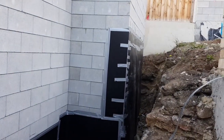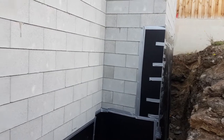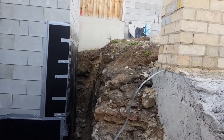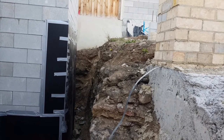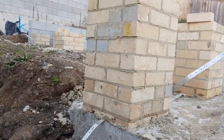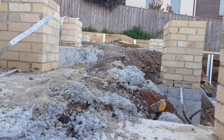Around here we're in the basement — actually under the house eventually — and this is the retaining wall from the back side. What you can see here is this black sheeting, which is the waterproofing that's going to protect the whole wall from any moisture that comes down through these rocks and into the underground, or what we call the subfloor. You can also see here some conventional construction — what we call brick piers — and these will also be supporting the ground floor work which the building will sit on.